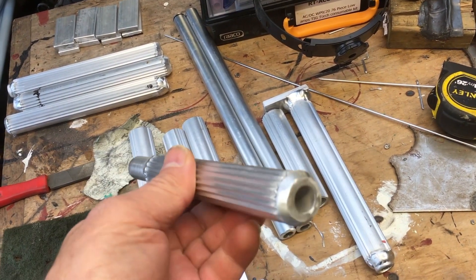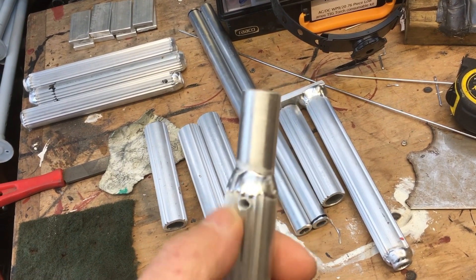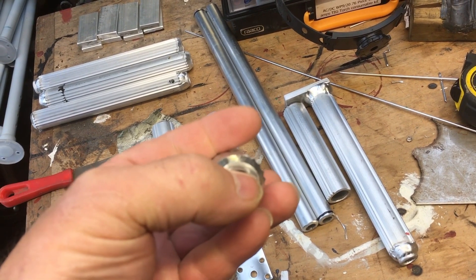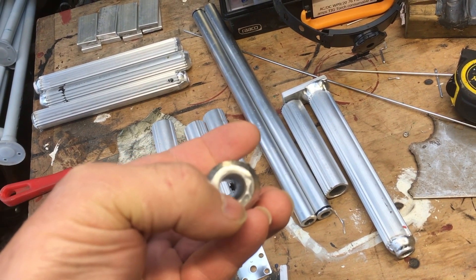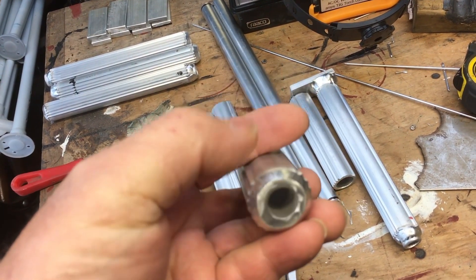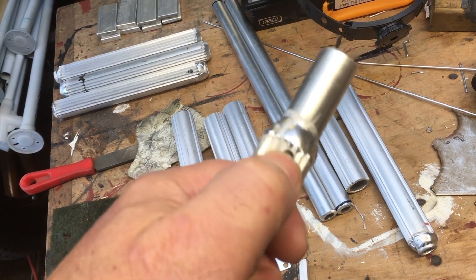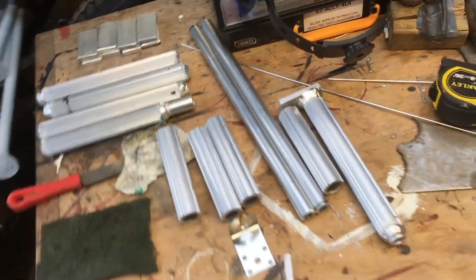Generally it welds up quite nicely around there, and then you weld up this end. But what I'm doing now is drilling a hole all the way through, because when I weld these into the mast and put my final plug in, it blows out a hole each time. Every time you start to weld, it overheats the air in the gap in the tube and makes like a little chimney through your weld. So to stop that happening, I'm drilling a little hole on the down bit that's going to be inside the mast tube. You won't see it anyway.